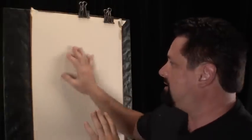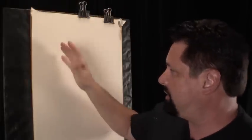Rolled it using a 3/8 inch nap roller, 3/8, very small nap. I don't want a lot of texture, like a 1/2 inch would leave. That's too heavy, too much texture, and the glaze will get caught in there and it'll affect the way my finish looks overall. And I use the mohair, just a nicer roller.